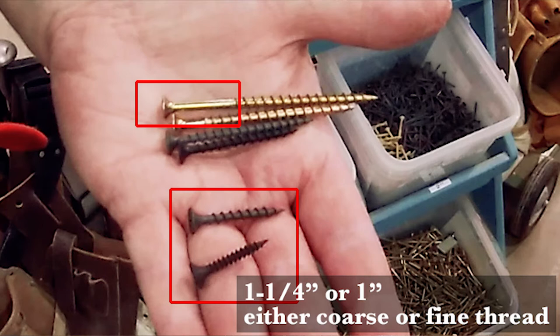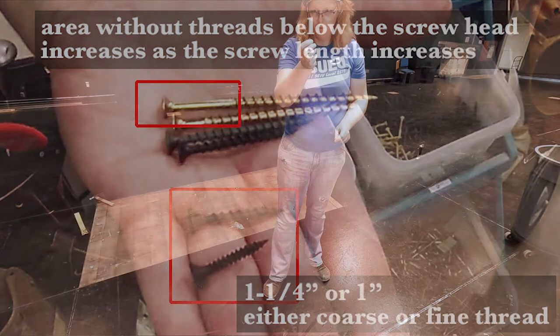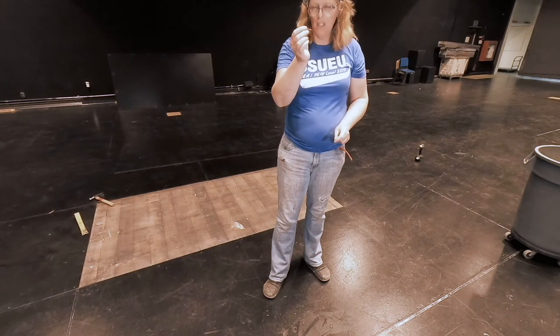So if that part is part of your lumber that's supposed to bite, that's going to be less effective. And the 1 5/8 just starts to do that. But you've basically got 1/4 inch of masonite, and you're sinking down a little bit below that because you're below surface. So it's just a little overkill.